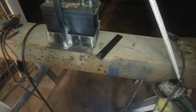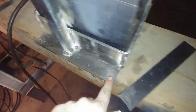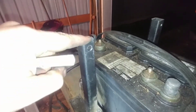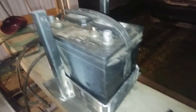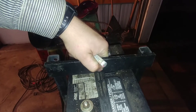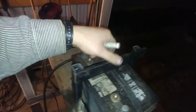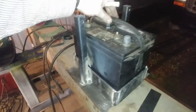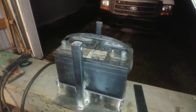I'm going to cut another piece of scrap metal that'll go over the top and hinge, so you can bolt the battery down — just more scrap metal. Off camera I went and drilled all four holes in the drill press, then drilled both holes here. This one's larger — about three-eighths — and this one's quarter inch. I'll go ahead and put this in there, mark the holes, and drill it. I made it with a little extra clearance to have room for this.